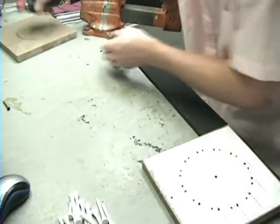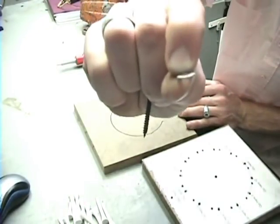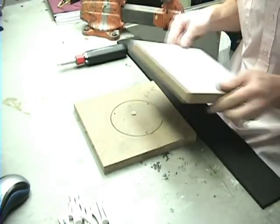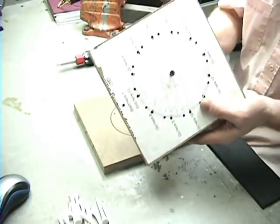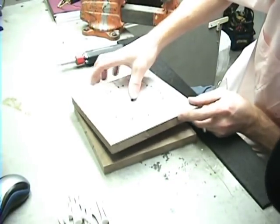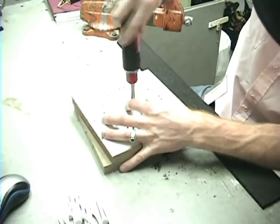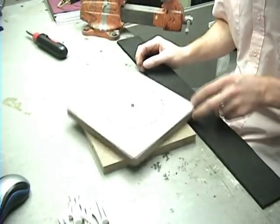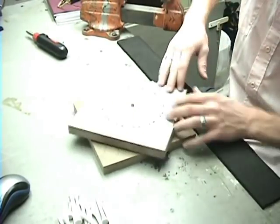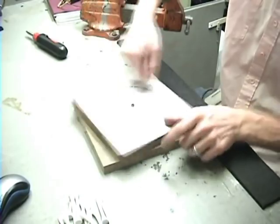Here's what I found out makes it a whole lot easier. Get yourself another piece of wood or a jig or whatever you want to do. Get yourself a real thin washer and a screw or a nail. I already got a hole in here — put that washer on there. Drill a hole in the center of your jig, right in the middle. Place that washer between the two pieces of wood, screw this down, and here's what you got. You got yourself a bearing, if you will. So now when I wind, I can turn my jig. It makes it a lot easier when you're winding the starship coil, because you just wrap, wrap, wrap, wrap, wrap — it goes by real quick.